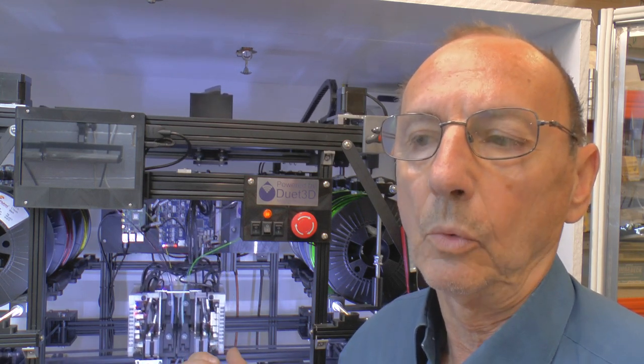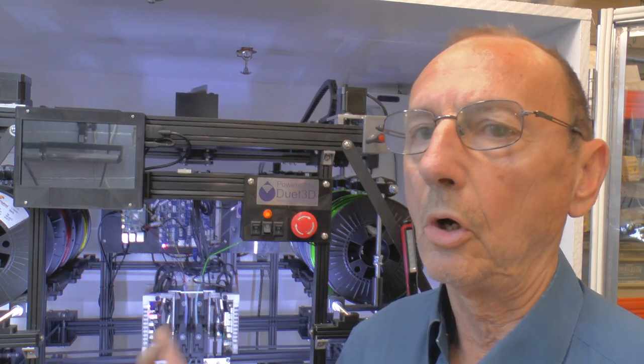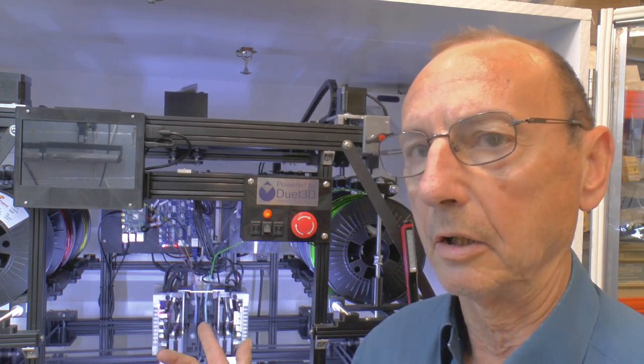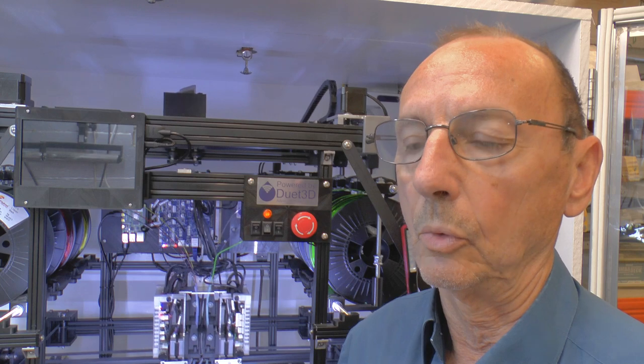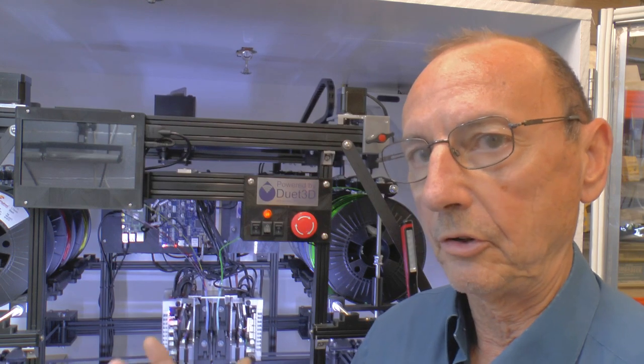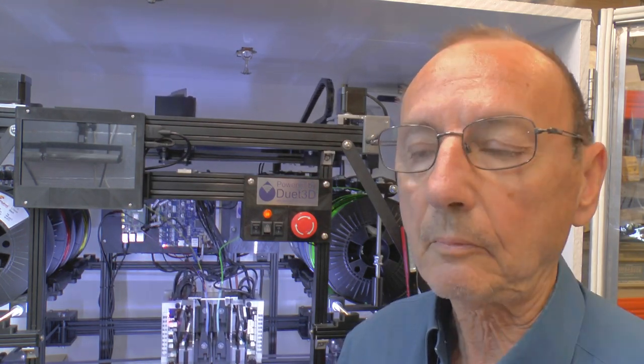Before, I had no motors on that UV gantry. It was just passively driven. Basically, they were just bits of string tied between the extruder gantry and the hot end gantry. So the hot end dragged the extruders around, which wasn't ideal. But one thing it was quite good at, because there's some slack in the bowden tubes between the two gantries and some slack in the string, was that when the printer's doing short zigzag infill moves, the hot end was zigzagging backwards and forwards, but because of this slack in the tubes, the extruders are pretty much stationary, which from a vibration point of view was quite good,